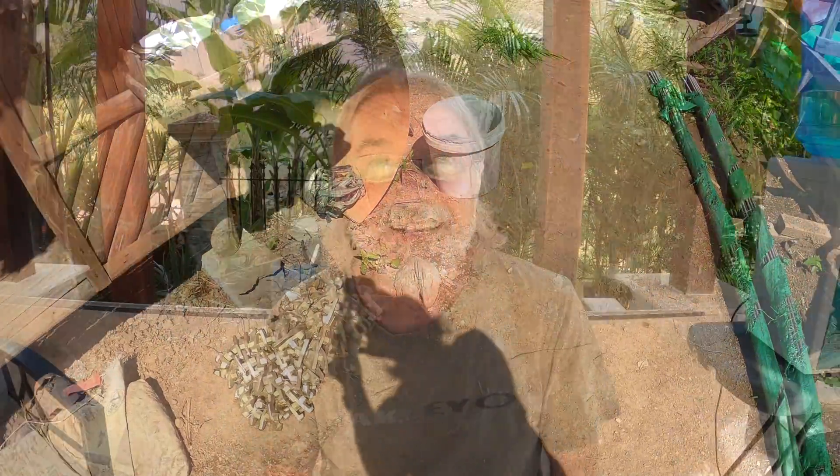I want to thank Romeo for that explanation. When they do the next pour inside the formwork, it'll be like big pour number two. There are going to be a lot of big pours here — not only did they do the footing support pour, they'll be doing the wall itself next week. They also have a cistern to pour. There are so many unique features on this build that you won't see anywhere else in this area. I'm really excited to see once the formwork comes off — it's going to produce nice, square walls with consistent thickness, extremely strong from the ready mix pour inside. That'll be one of the upcoming episodes.